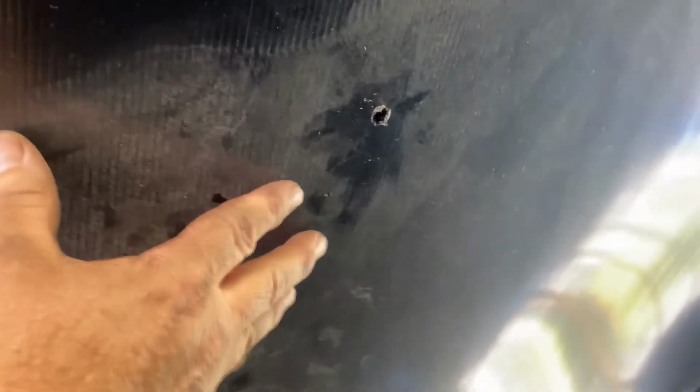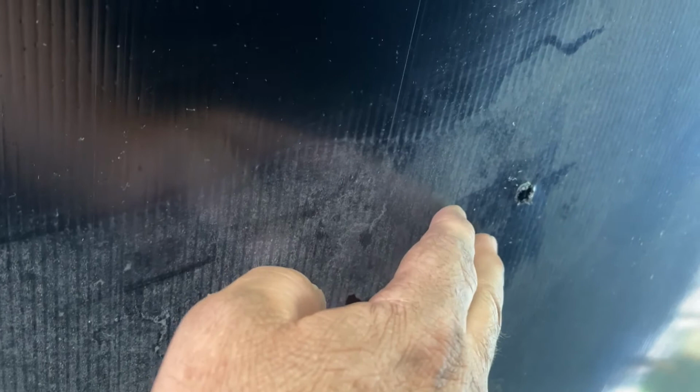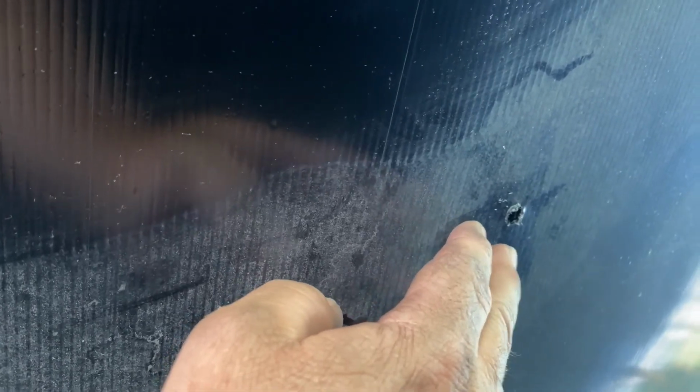this stuff's not sealed. I mean, there are gaps all along the frame. It's not like it's airtight. It's not bug tight. It's not watertight. So really wasn't worried about the integrity of that so much. The reason I did this is because had I had a drain here, I would have discovered this leak a long time ago, I think, because by the time I got to it, there was a puddle right here on the other side of this of hydraulic fluid.